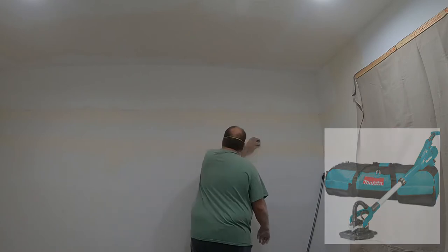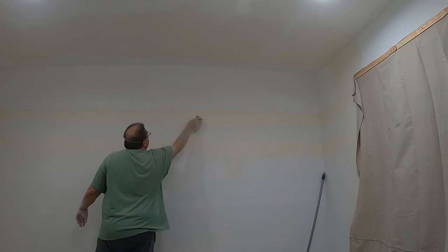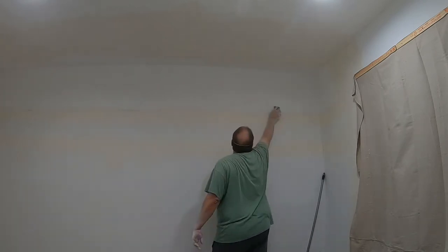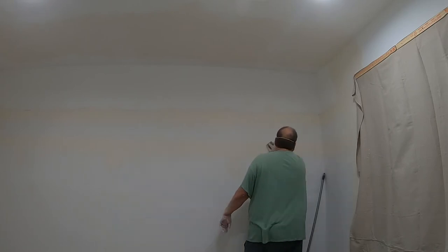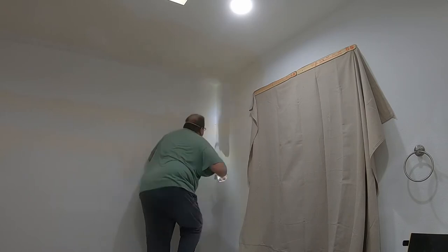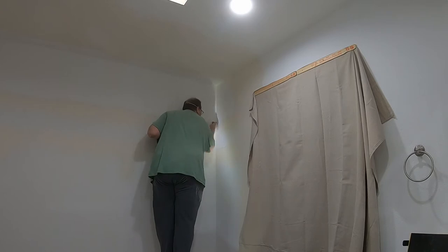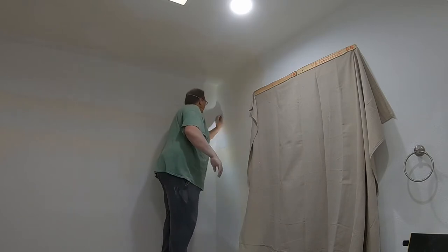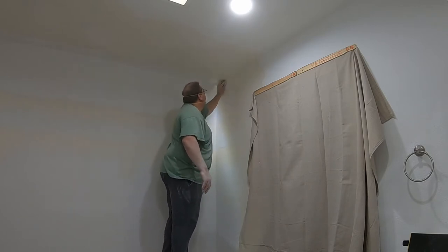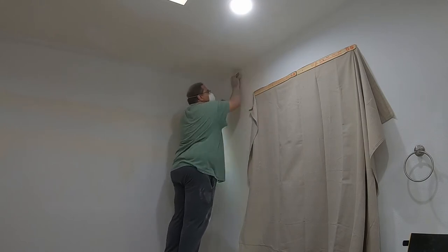It was just great the way the vacuum would suck all the dust up and everything attached to it. What I'm doing here to make sure that fine dust doesn't float its way out into the master bedroom: I've turned on the fan in the inner bathroom where the tub and shower is to build up some negative pressure in that outer vestibule area I'm working. That's going to draw some of that floating dust into that area, and it's a lot easier to clean fine dust off tile than off furniture.